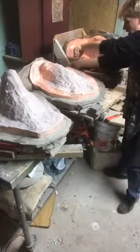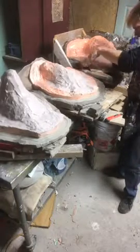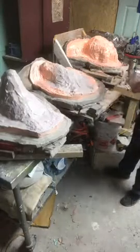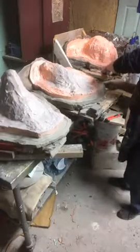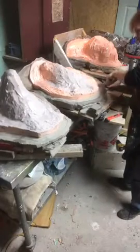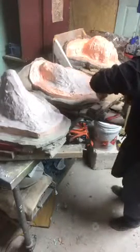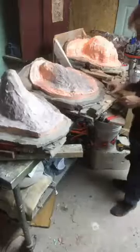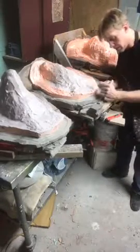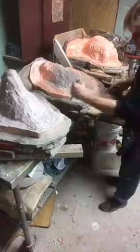All right. Now I'm cutting down along the mold wall. Not for any reason except I'm trying to make sure I have a consistency of my width, so I know where I'm putting my fiberglass, and I know I need to go all the way out to the edge of that and fold over. It's not really for a prettiness factor because I'm gonna have to grind the darn mold later anyway. But it kind of makes it a little easier for me to work with.